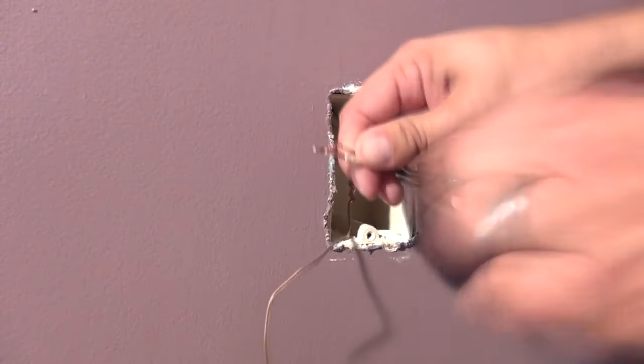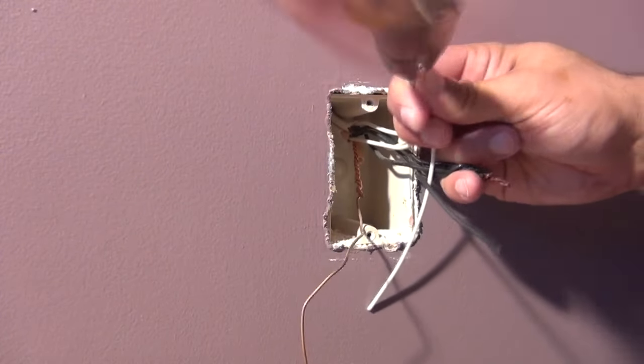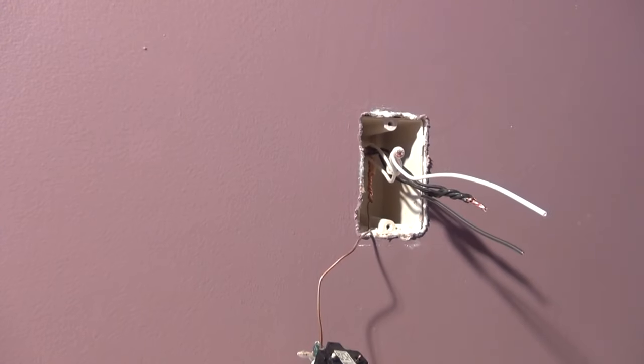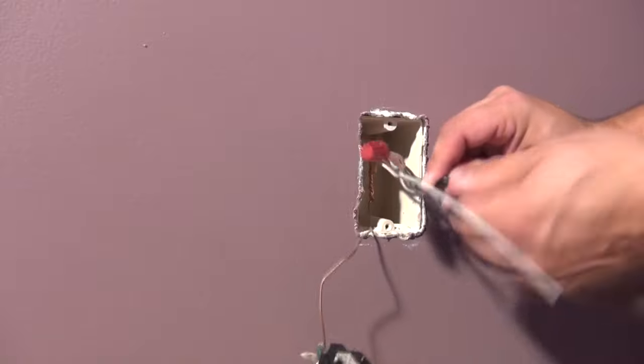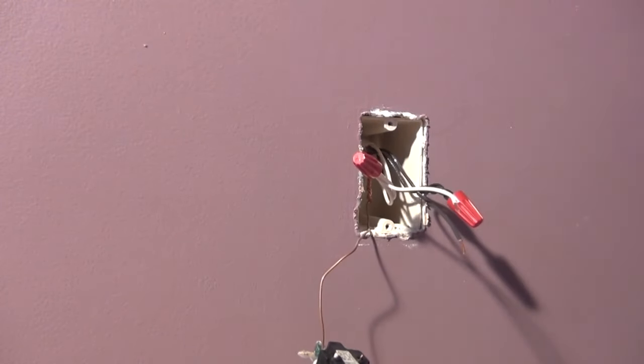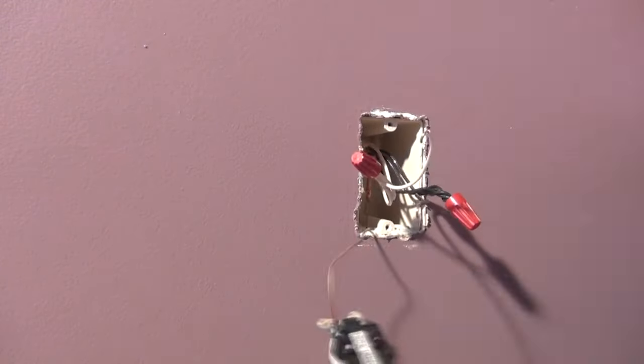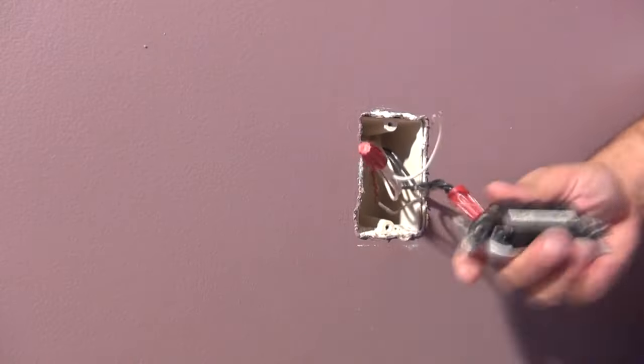Take your wire dykes and twist all those wires together well — you never want to solely rely on the wire nut itself to keep everything together. Give everything a good twist so it stays nice and secure. Same thing here for the neutral side. We have four hots and four neutrals in this box, all connected together, which will complete the circuit the way we need it. The wire nuts go on — make sure you screw them on good and tight so there's no chance of them backing off. Then trim the individual conductors to the same length, strip off the insulation, use your needle nose to put a nice J-hook on the end of both wires, and remove the pieces of wire stuck in those stab-in connectors using a small slotted screwdriver.